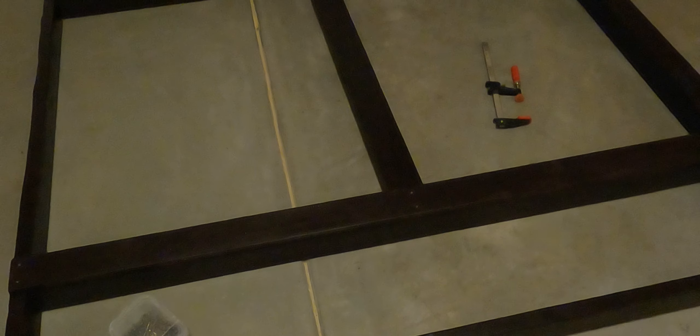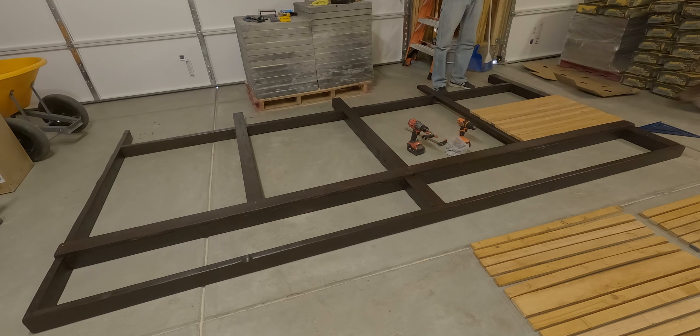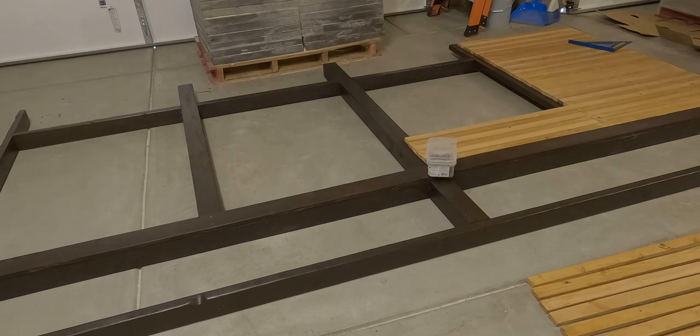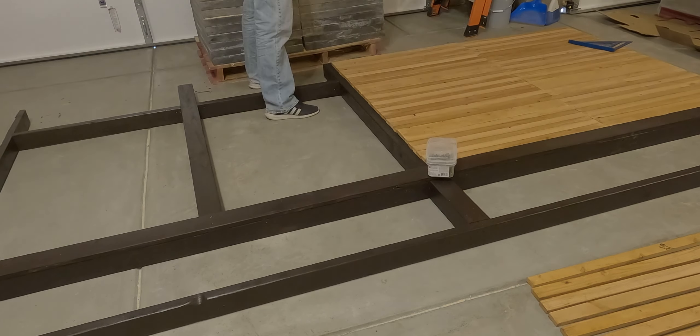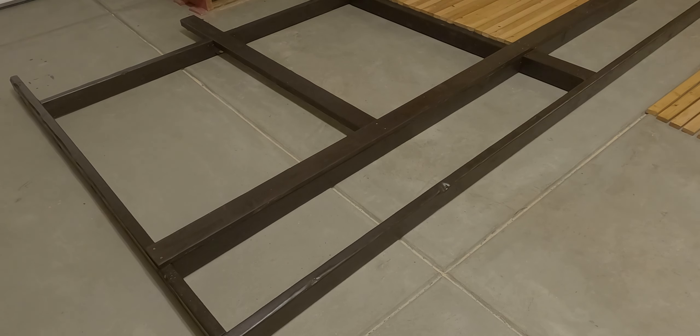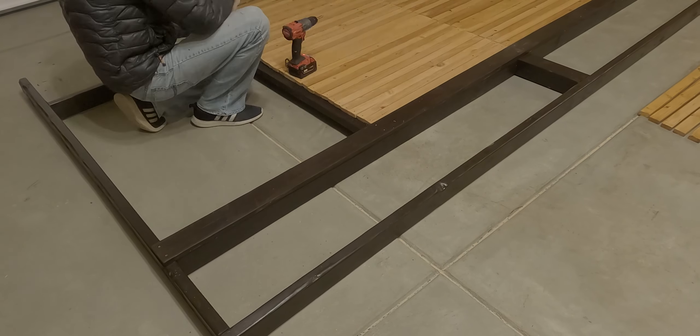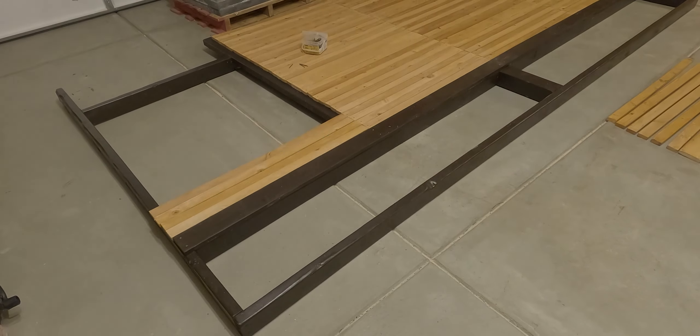Now that everything is painted, I've got to let it dry and then get ready to attach the boards. I did notice that some of these boards began to sort of twist and warp because these are not finished — not pressure treated or anything. This is kind of unfortunate, but it is what it is, so we'll see how it turns out. I ended up using low profile screws to attach the side boards to the frame. Since there were so many pieces to attach, it just took a very long time. I also had to pre-drill everything to make sure there's no cracks or splits — I didn't want this thing to break before I even put it up.